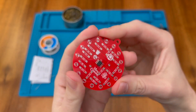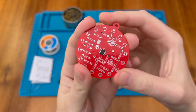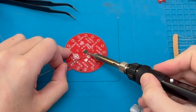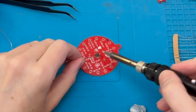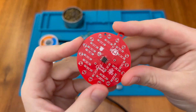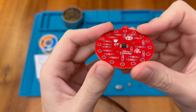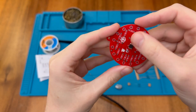We have the chip reasonably well aligned, so I'm going to solder on all the other pins and then touch up that one if necessary. I'm reasonably happy with that. Maybe it could have been a bit neater with a finer tip but it seems to have done the job — that looks like it's connected just fine.